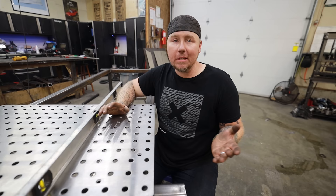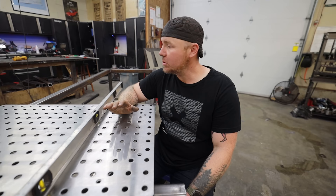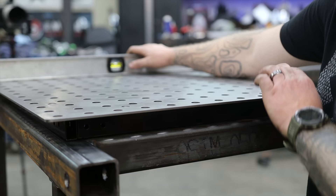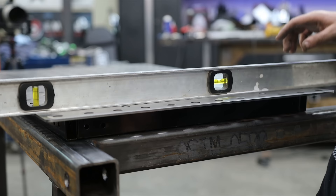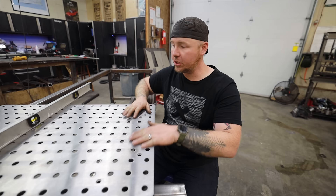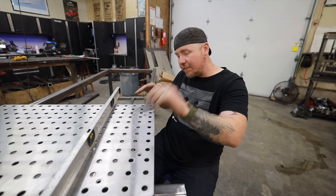I'm going to unbolt this from the frame and recheck flatness — I'm guessing that once there's no tension pulling into a warped piece of steel it's going to level out. And that is so much better — right where those two bolt holes are it just dove down. This confirms the frame isn't very straight. Ironically, if the people who built these frames had used a fixture table to tighten everything before they welded it, it probably wouldn't be so warped. But we can achieve a higher degree of flatness just by loosening everything up, and later I might shim underneath some of these holes before tightening back down.